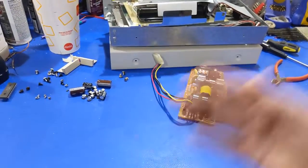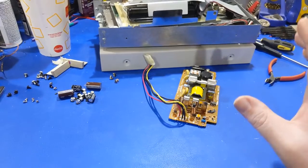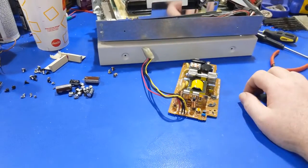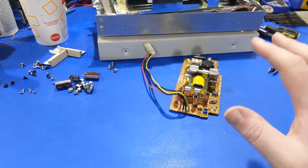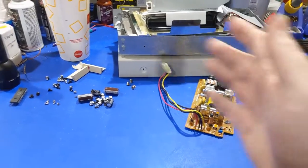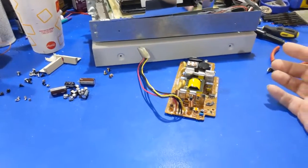There's a small narrow range in between the two plague eras where everything's all right, and up through the early eighties they seem to have very solid capacitors too — not everything was affected. There are niche situations like a CRT TV made in '91 or '92 where you might have one or two capacitors that are bad — common fault caps sat next to a heat sink — you replace those two, it works great and doesn't go bad for another ten or fifteen years. But that's not the norm anymore. This here is the norm — it's almost like collectors in the nineties grabbing forties, fifties, and sixties radios and TVs, knowing they've got to change out every single one of those wax paper capacitors because they're guaranteed to all be bad.